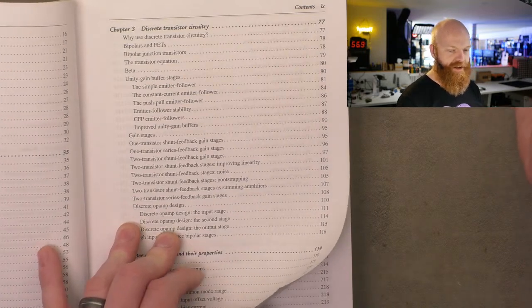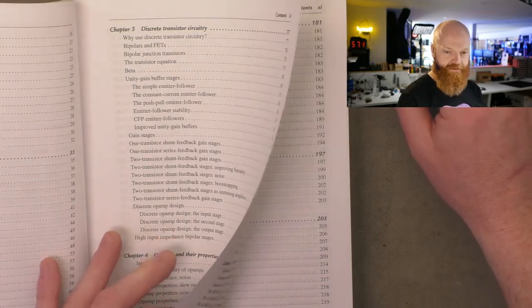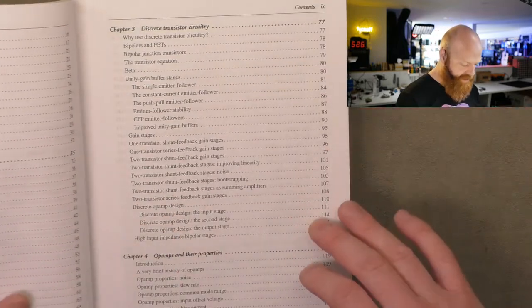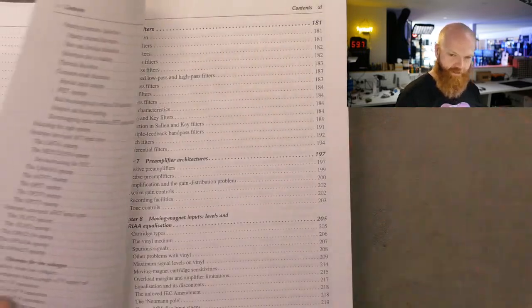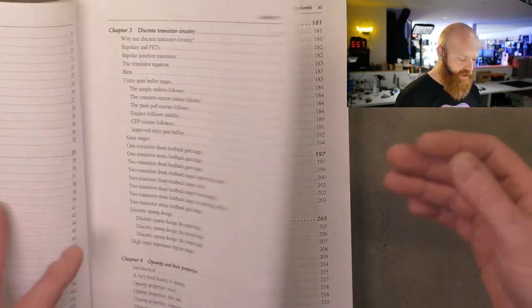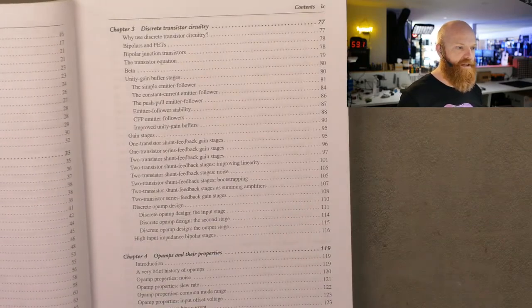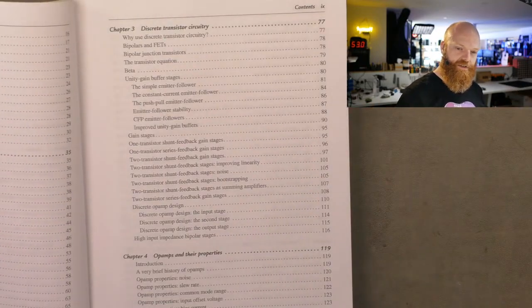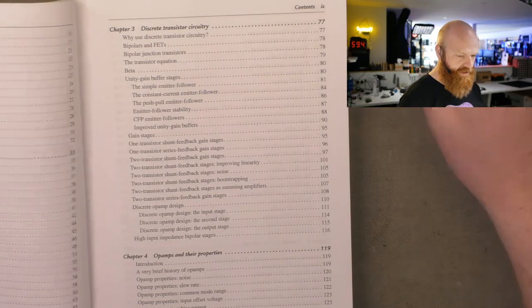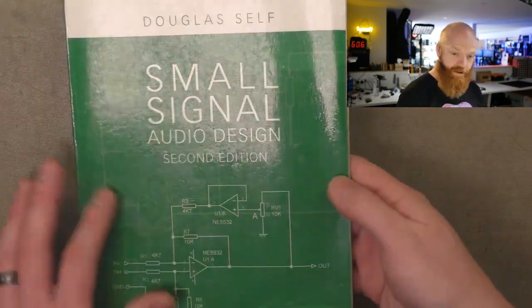So this is what I should be seeing here, this is the voltage I should expect — why am I not getting that? Well, the transistor's dead; 90% of the time that's what it is. But it's good to know at a glance what each little building block that makes up the whole circuit is and what it's supposed to be doing. Then it's like learning a language — eventually you can read the whole sentence, which is the circuit, instead of looking at a bunch of individual letters and getting confused.